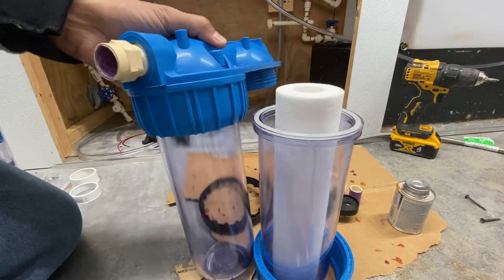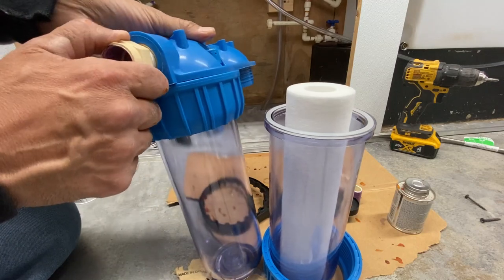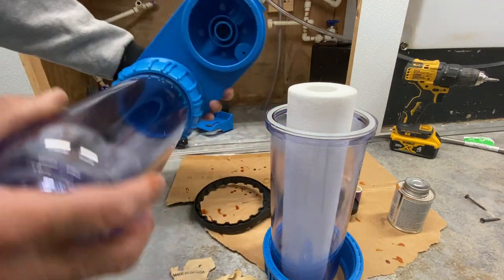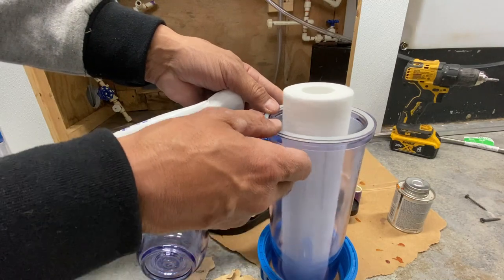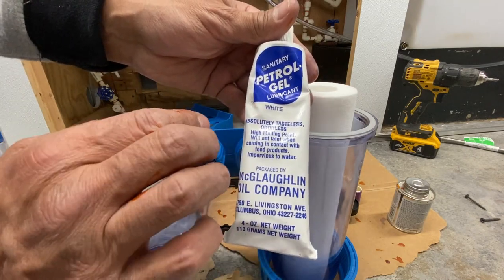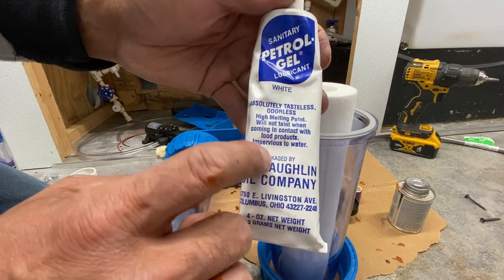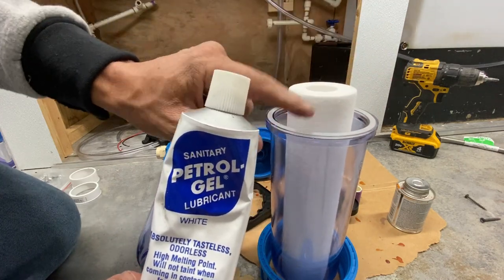At the filter, I used blue plumber's tape around the three-quarter-inch CPVC fittings on both sides — four or five wraps — so there's no leak. Since the filter is in place, I'm putting in the filter cartridges. For the rubber grommet gaskets, use a sanitary food-grade gel lubricant — this is specifically rated for contact with food products and is impervious to water. Just put a little around the seal so it doesn't dry out over time.